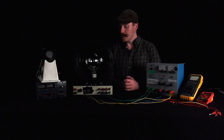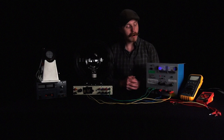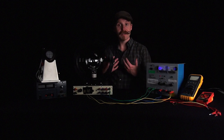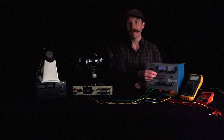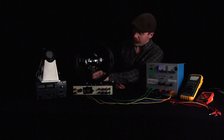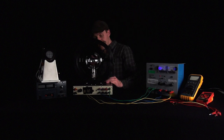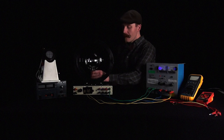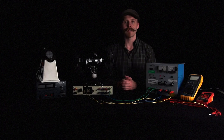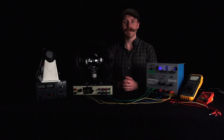When we get around to playing with the Helmholtz coils, we can increase the current going through them to bend our electron beam. We can make measurements of the radius, vary our accelerating voltage, and vary the current through the coils. One of the things we'll also have you do is gently grasp the base of the tube and rotate the electron beam to different angles. You can actually make this beam shoot straight forwards, which is pretty fun, but we're going to ask you to at least slightly turn it about 10 degrees forwards from horizontal, and when you're ready to take measurements, turn it nice and sideways.